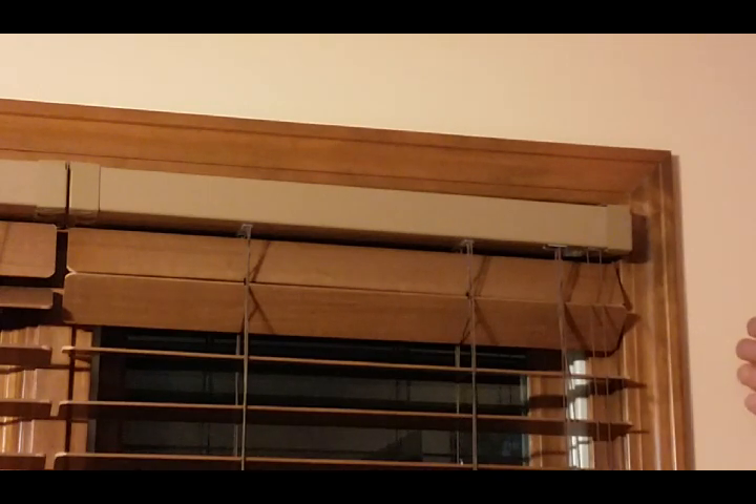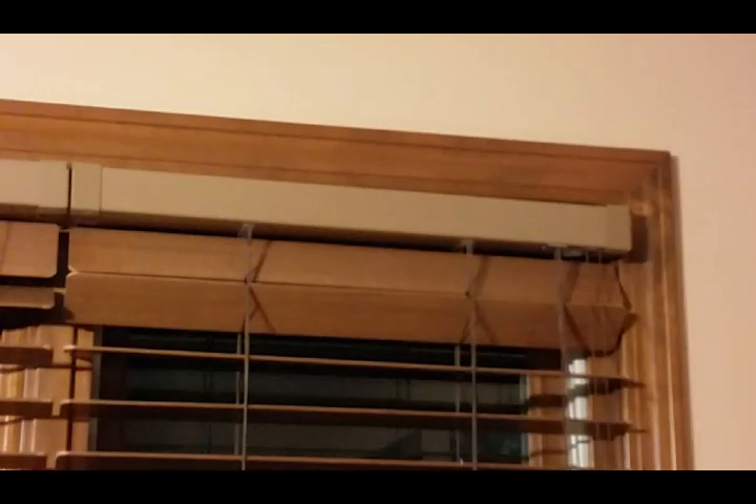If you had a corner that was 80 degrees or say 85 degrees, you would need to cut that at 42 and a half degrees on center. To get that 42.5 cut, remember that zero starts from the fence and zero on the miter saw is straight ahead. Alright, YouTube friends, thanks for watching — hope this really helps.